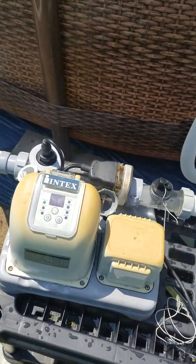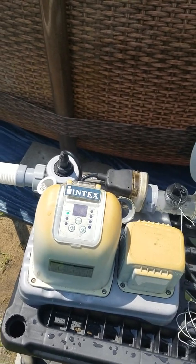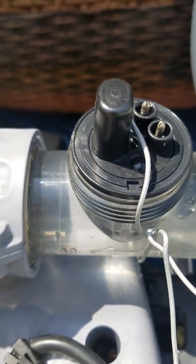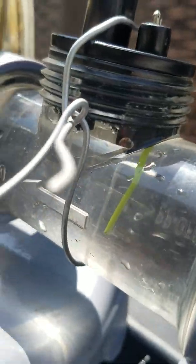It's been running for several minutes with the working light on and it is generating chlorine — there are some bubbles showing up in the water. So I will update this as it goes along, but it's looking like I may have to replace that switch.